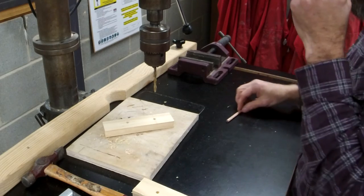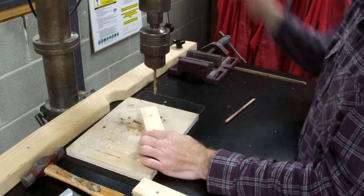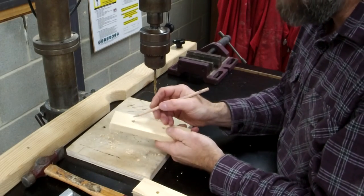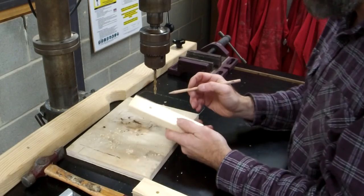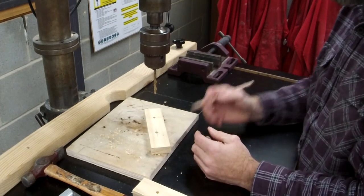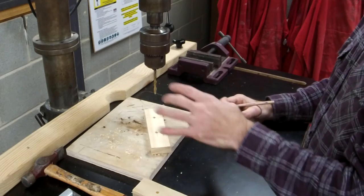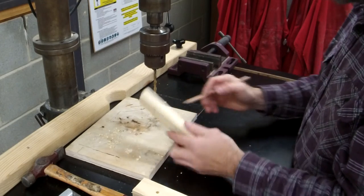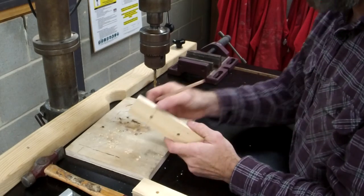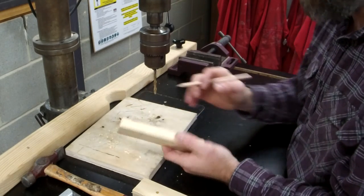My last hot tip: when you're drilling, everything is fine, but it's best to gently ease out of whatever you're drilling into — you get a nicer, cleaner exit. But also, when you bust out through the back is when something can go wrong. If you're too harsh or not holding tight enough and you bust out through the back, a jig can potentially move. Everything should be nice and safe, but that's the moment to be really careful.